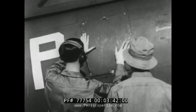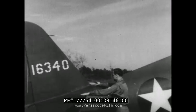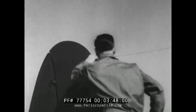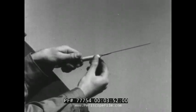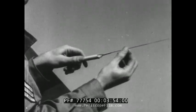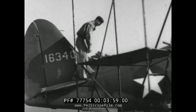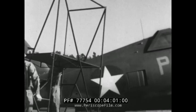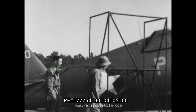When you're satisfied with the equipment in this compartment, replace the access door and you're ready to start the antenna inspection. Where there's a 274 set, there's a fixed wire antenna. Check the shock spring for possible corrosion and the insulator for chips or cracks. The wire must be taut and in good shape. You'll need that work stand to reach all of the antenna, unless you happen to have a skyhook handy.